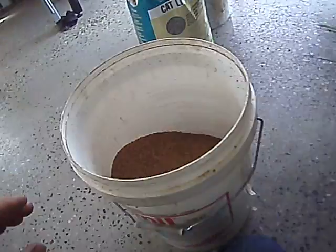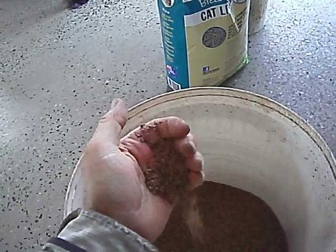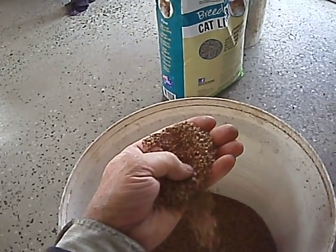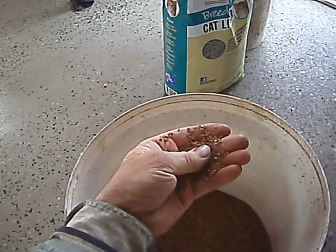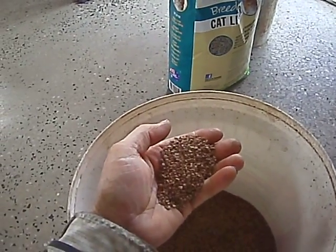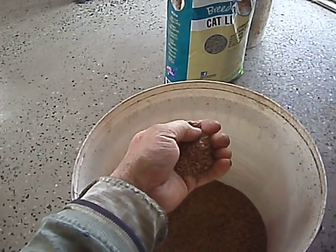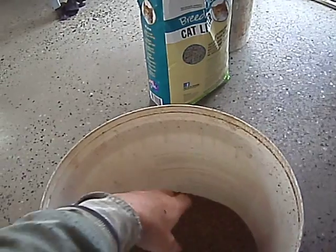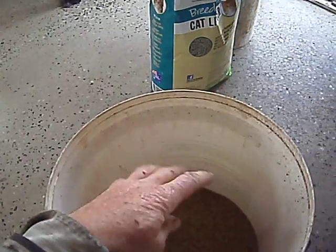The fuel we're using is the crushed olive pits — these ones here. They're an excellent fuel but they do need to be well prepared. They need to be mechanically dried and cleaned because any extraneous matter in them just blocks the chute. And if the moisture is over about 5% then it just reduces the performance of the fire. These have been dried in a hopper dryer and then had the dust and fluff blown out before use.